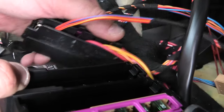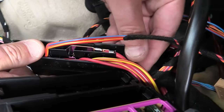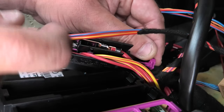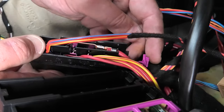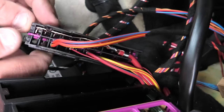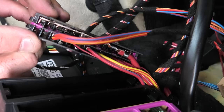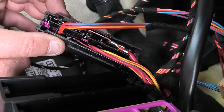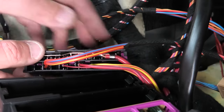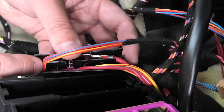One thing the instructions don't tell you is that when trying to push the connector in, there's a locking clip. What you have to do is pull that out just enough to expose the connector, push the wire in until you hear it click, then push the tray back in — that locks the cable in permanently. I spotted a little purple tab and realised: pull that out, push your cable in, and click it back in place. They're using that tray to run over the top so it'll never come out — genius design, but I couldn't figure out why the cable wouldn't push all the way in.